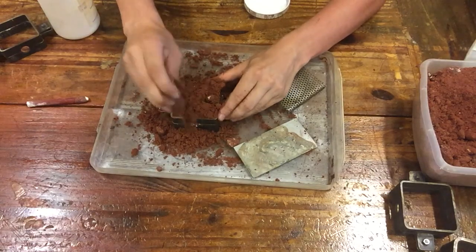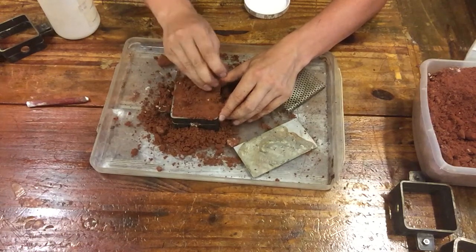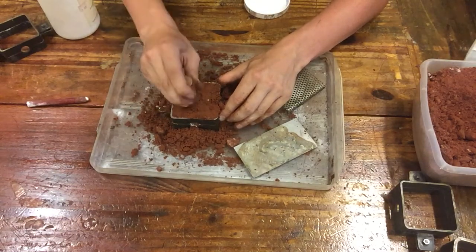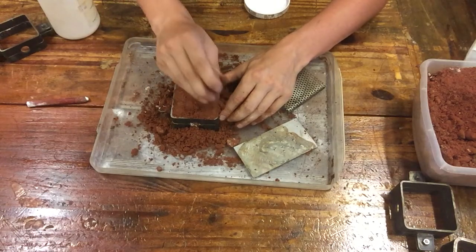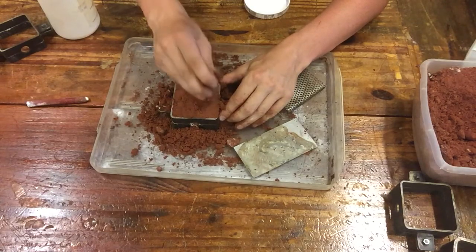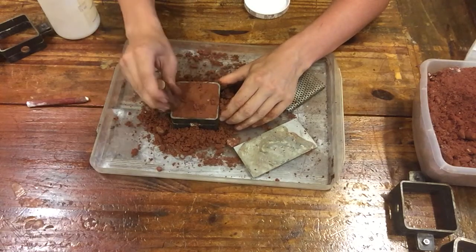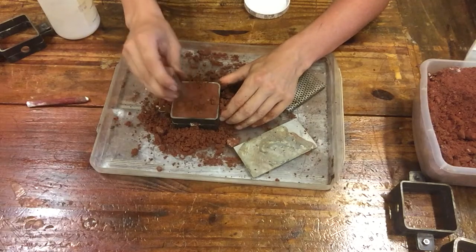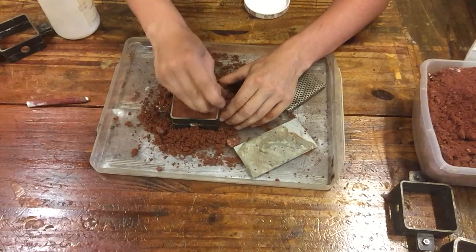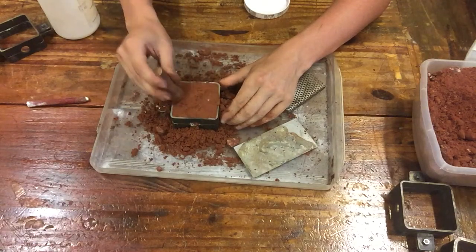So there's no rush, just know once you've got that smooth powder coat, you don't have to worry as much about compression. Just that top layer needs to be the fine stuff to capture all of your details if you're doing very ornate drafted objects that you want to keep all those details. The powder is essential. If you're looking for that rough antique feel, something, you know, early Bronze Age, it's okay to rush it. But if you want to have nice refined parts, you're gonna have to take time and sift that powder with the screen until you cover your part completely.